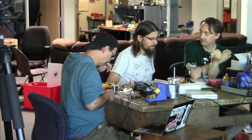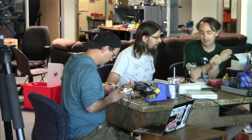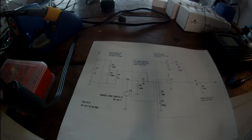All right, so how do we make this AC coupled into the center of the rail? We're using an equal value voltage divider here to derive a reference voltage for the input of the op amp. The coil input is actually this voltage source. I misspoke a moment ago. We're coupling it into the system through a large capacitor. From the perspective of the coil, that capacitor isn't there. But from the perspective of the DC offset that we generate here, it doesn't flow backwards into the coil.